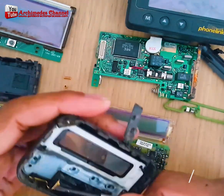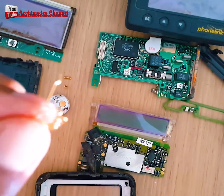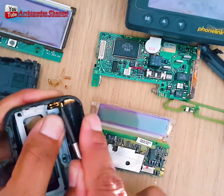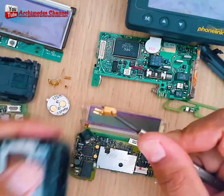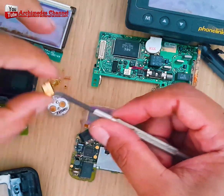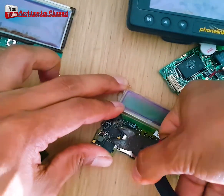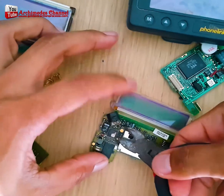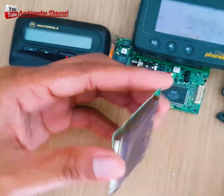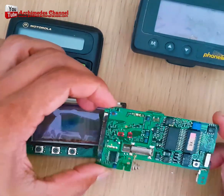Take a look as it's disassembled — all the different parts are focused on; even certain coils and springs could be coated in gold. At the start, especially if there's still plastic attached or lots of other metals, it'll soak in a watered-down or diluted nitric acid solution for up to a week. After that, it will be dropped into an aqua regia solution — a combination of nitric and hydrochloric acids — and that is definitely a process that will give off toxic gases and is extremely dangerous.